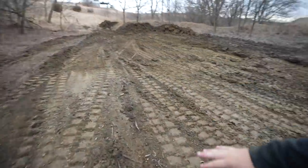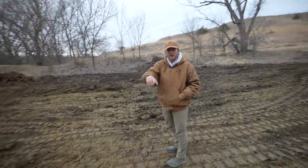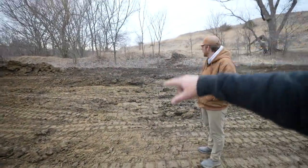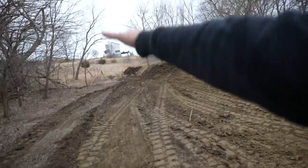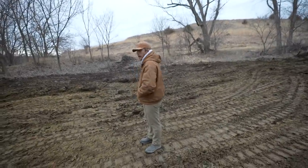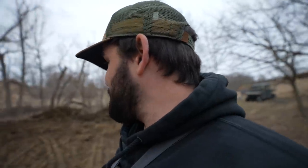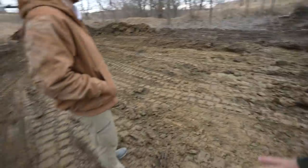In case we get a huge rain and don't want to sink our stuff, I left a little bit more shallow in a couple areas here, and then there's a deeper side. What I could do is shave this down to that elevation and take that berm and shave it down to that elevation. My entrance that comes in gets high, so I'll take that out too to make sure the water flows in here. A quarter acre pond - probably decent size. I feel like we're going to be having fun with the mud, but it's already muddy. There's a sprinkle and we're already going to be in business. I'll back drag it, smooth it out, make sure it's all packed in looking decent. This is going to be less than an hour for sure. Just move a couple of high sides there, smooth it out, really shape that bowl - should be good to go.